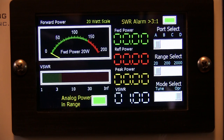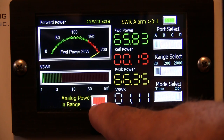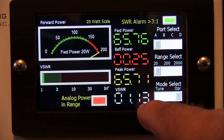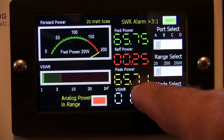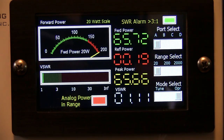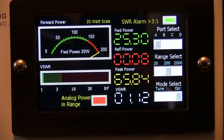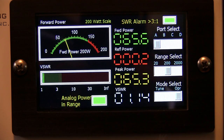I've moved the range select down to 20 watts while the radio is still at around 68 watts. When transmitting, the analog meter is pegged and you get a red indicator. SWR is showing 1.10 and we're showing around 65–66 watts total output — so basically you get an alarm at the bottom. Putting the range back to the proper 200-watt scale and transmitting again, we're now reading a green indicator for power in range and 65 watts on the forward power scale.